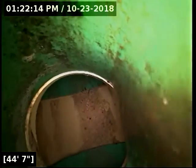Got some standing water here in the line. We'll take a look at this when it's all drained out at the end. Get an accurate level of water there. Now where I typically start to see toilet paper collect and where my recommendations for repairs start are when you have at least 5 feet of pipe with at least 1 inch of standing water in it. That is right where I start to see regular old toilet paper start to collect in lines, not just paper towels and stuff that shouldn't be going down them. So we'll see what we're working with there, all said and done.